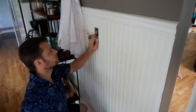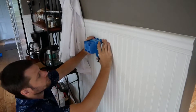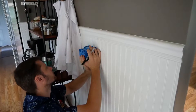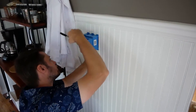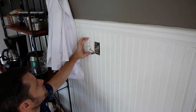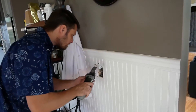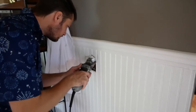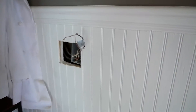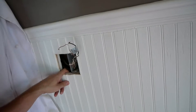I've loosened up the box on the inside. In order to take this out, I'm going to cut the hole larger so I can put the old work box in. First I'll measure and mark everything so I know how large to make the hole. We'll cut out an additional space, pull the old box out, and put the new one in. Once the hole is widened, we should be able to pull this old box out, put the new one in, pull these cables through, and hopefully pull our new cable in up from the basement.